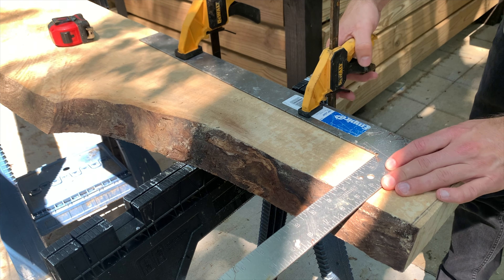I took a little bit of caulk to seal the slabs down into the form so epoxy would not seep beneath them — there was a lesson learned with this strategy that I'll mention shortly. I repeated this process for the second coffee table, and for both tables I used a bunch of bar clamps to clamp the slabs down into the form to reduce the likelihood that epoxy would find its way beneath the slabs.